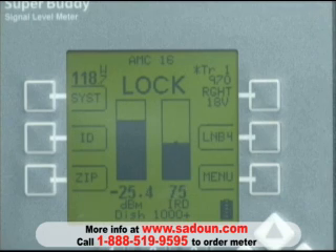It looks like I've seen about a 78 or so. Subtly adjusting — that's just about optimized right there. I should mention that when we connect to that middle LNB, which is the 118.7 and the 119, there's labeled on the bottom of it one F for the FSS, which is the 118.7, and the other connector is 1D, which stands for the DBS or the 119 satellite.